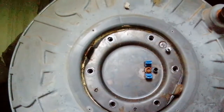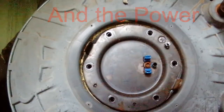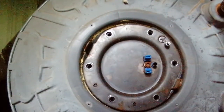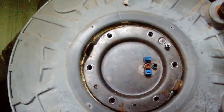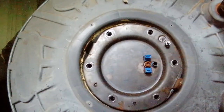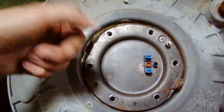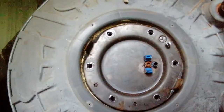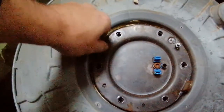Before opening these hot water cylinders, you've got to turn off the inlet water valve — close that tap so no water rushes in. Then open up the outlet drain pipe and let the water drain out. If it's not in the roof space, I open it up slightly while keeping some bolts in — it drains quicker that way. Otherwise you'll be waiting a long time for it to drain. Then let's open it up.